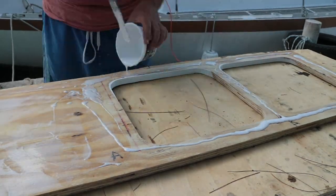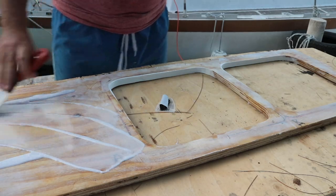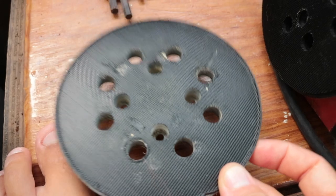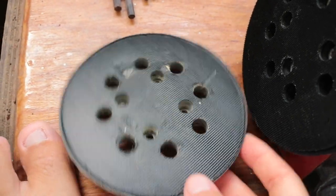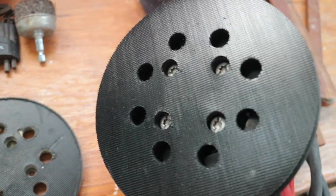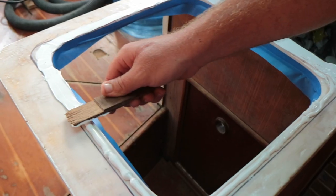When you do a lot of cooking and a lot of dishwashing, you really start to think about how water-resistant you want your boat countertop to be. We laid the epoxy on as much as we could spare on both the top and bottom side — epoxy, sand, epoxy, sand. But now that the epoxy was flowing, the sander was breaking down. I changed the bearings again and we had to order a new velcro pad as well. It's night and day between the old and the new — the old one won't keep the sanding disc on at all. With the countertop prepared, we applied the Sikaflex sealant and glued on the sinks again with a couple of screws just to hold things in place.